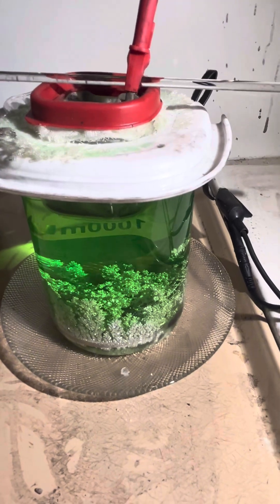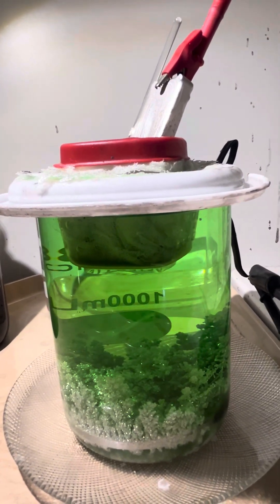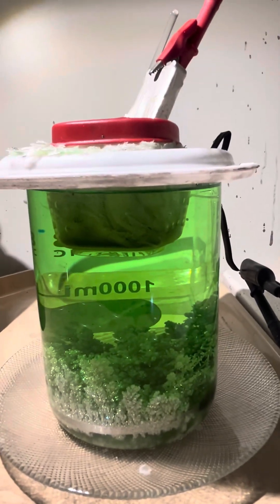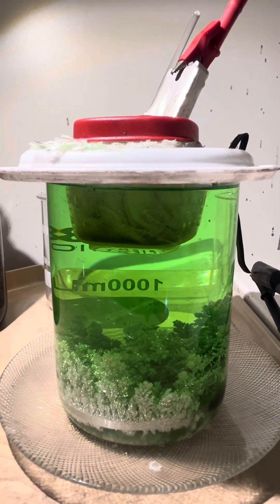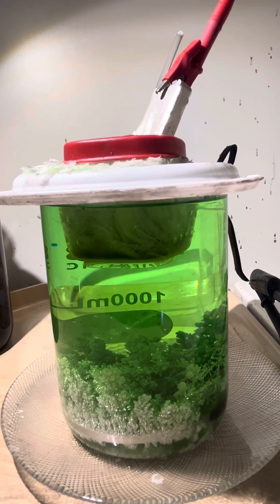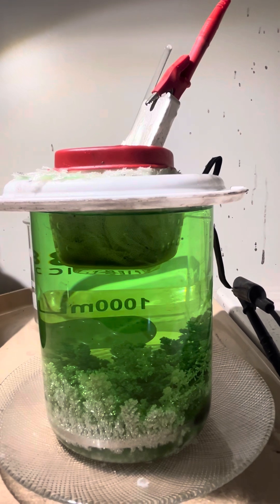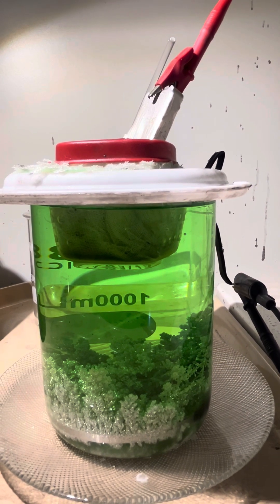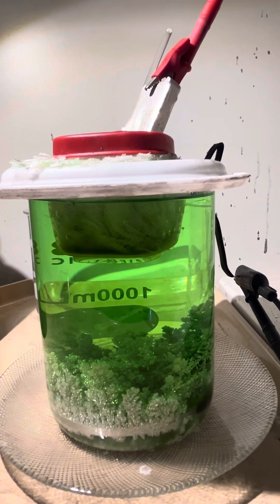We're back, the bar's in, we're going to let it roll and check the crystal growth out in the morning. Let's see how far we can take this — if I harvest on Sunday it'll be batch number three, but I kind of want to see if I can get four or five batches out of it. The solution is still translucent, a little green. I was thinking of dropping it as silver chloride and extracting the silver, and getting some DMG to test for palladium or if that's just copper. The solution still looks good and I don't have to titrate with nitric yet — I feel like we could probably go a couple more days before I top it off.